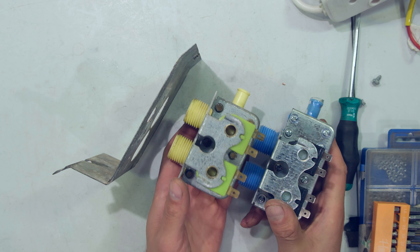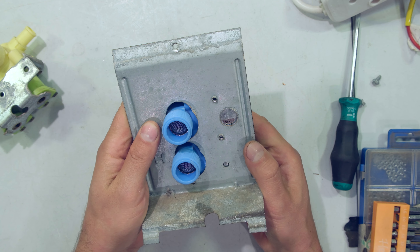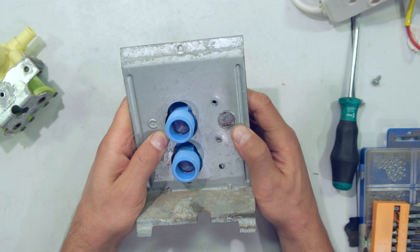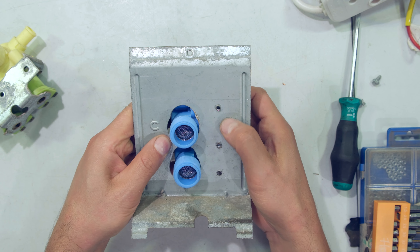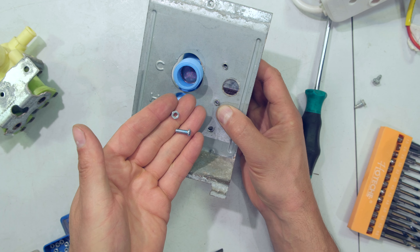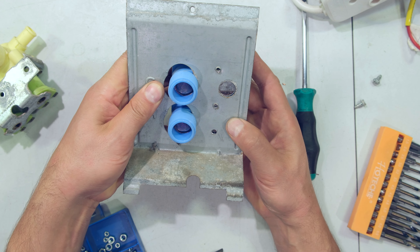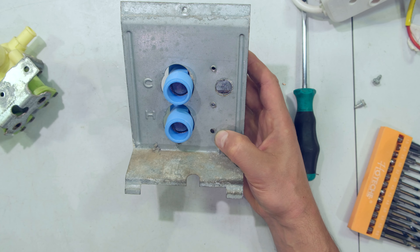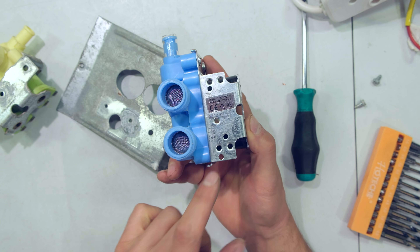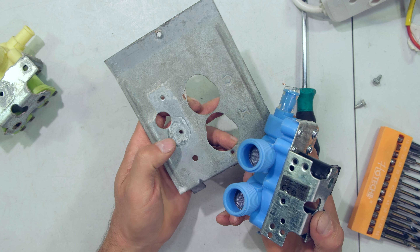Here's the replacement next to the old one - it fits fine physically, but the screw holes do not line up. There is one hole that lines up, but the others don't, so I have to decide: place it exactly in the center and drill new holes, or use the existing hole and opt for a nut and bolt instead of a screw, then drill one additional hole on the other side. I'm going to use the existing hole with a nut and bolt and drill another hole to hold it firmly. The face plate actually has many holes to make it versatile for different machines, but my plate only has three holes.